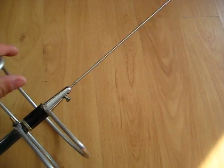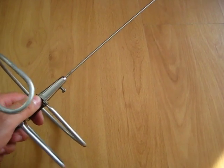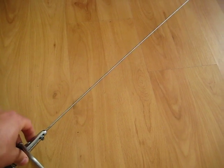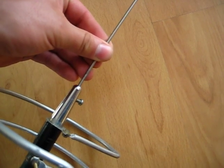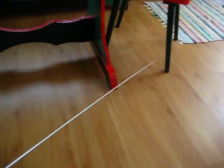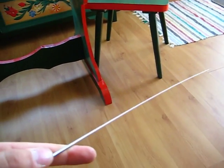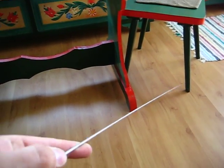Here I have a hard plastic insulator with two screws going into it. This is the upper part — the half-wavelength element on top, which is cut to size from a car CB antenna. I can tune the antenna from here too: by loosening the screw I'm able to slide it in or out. It's pretty flexible, it's lightweight, and the wind can't grab it so hard.